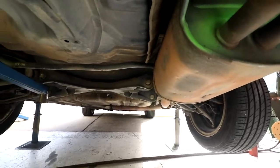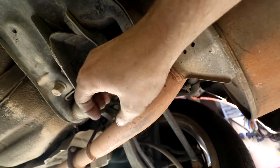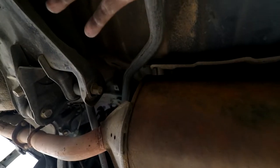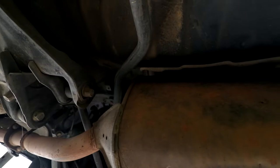So what we're gonna do on this end is the bolt's taken out. So we'll have our tube hanging down here. We're gonna have to have a small angled piece across and then we can come down. So where our joint is gonna be, you could tube bend this and use like the roll cage. Yeah, I'm not gonna bother doing all that. It'll be fine, cut and welded at an angle, and then we'll just plate the bend.